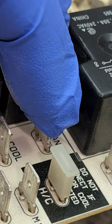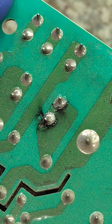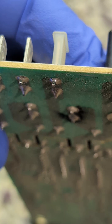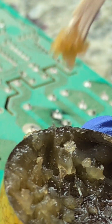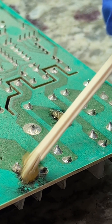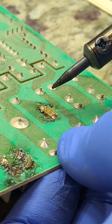You can see from the fan pins, the two solder joints that hold the connector are completely separated from the actual circuit board. I'll start off by putting flux all over these, get them heated up and try to re-wet those solder connections and get them solid again.